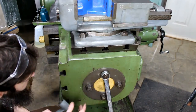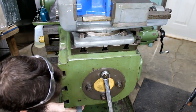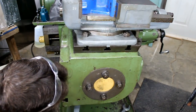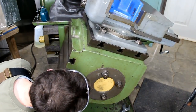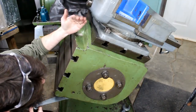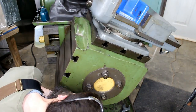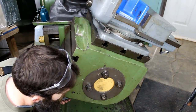I want to set this up pretty accurately — not because I need to, just because I want to. First thing I'm going to do is rotate this box 25 degrees. There's just a crank down here; I had to loosen these four bolts. This vise is extremely heavy and pretty tough to move back into position. That's one good thing about the universal table — it allows you to rotate the box and pivot the vise forward and back. I'm just lining these marks up by eye and I'd say that's really close to 25 degrees.